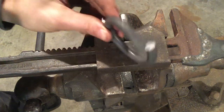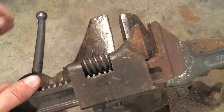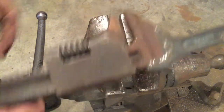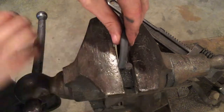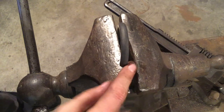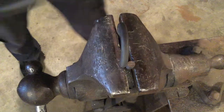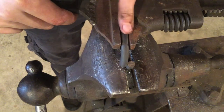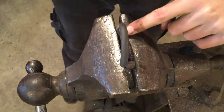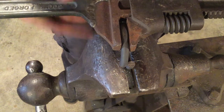At this point, there's an O-ring, but you'll notice because of the way the helix wrapped, it doesn't line up perfectly flat. The easiest way to address that is with a tool called the twisting bar — a long handle with another handle welded to it so that your center rotates about the jawline. It's just like a vise but with handles so you can spin it around. Clamp this work firmly in the vise so you can see that position one of the helix and position two do not line up. Take the twisting bar, clamp it on the top radius so you have enough that you can rotate the bar without much resistance. Because the vise is clamping the back of the arc at the halfway point, just like the start of the helix, you will get a nice uniform alignment.